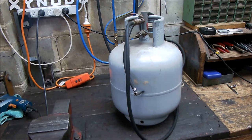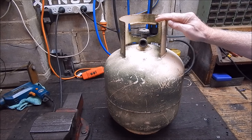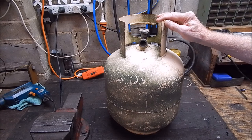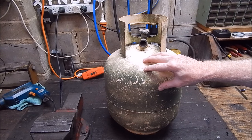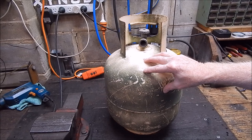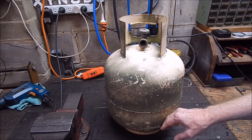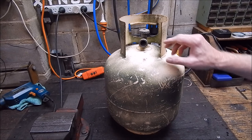Here's your basic old LPG propane 9 kg bottle — use whatever size you want, but this is a handy size you can carry around. It's not heavy because there's no liquid gas in it, so it's not like humping a full LPG cylinder. First off, these are pressure tested more than twice as high as a normal air compressor so they are immensely strong. They don't have a drain valve, so you can only put dry air into them — not air that hasn't been through a dryer or filter, otherwise you get moisture in the bottom and can't drain it off.